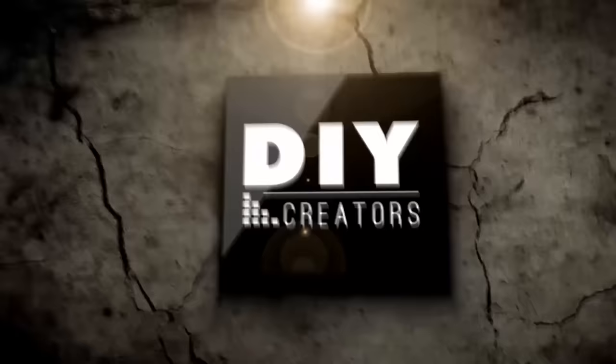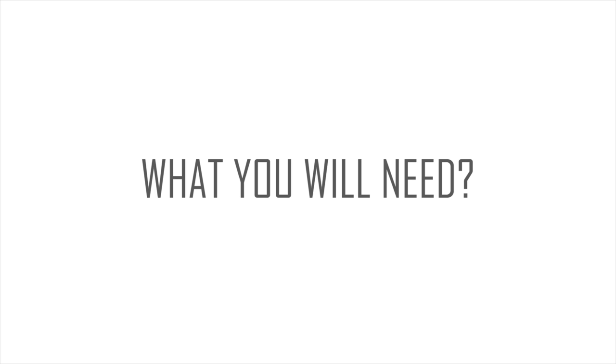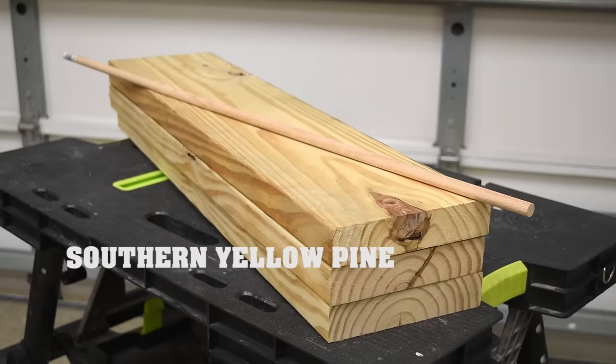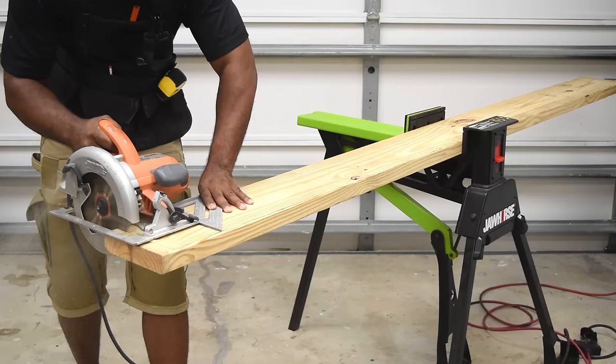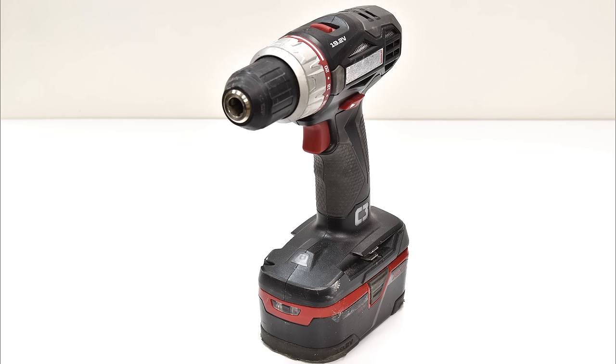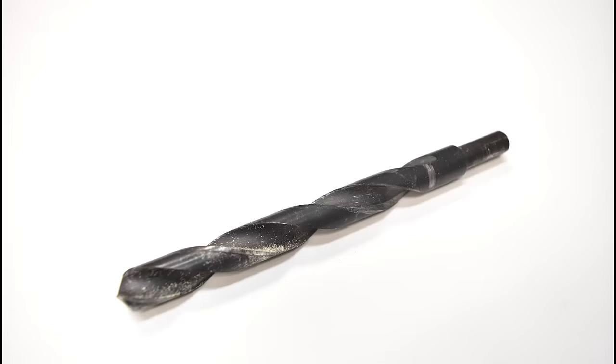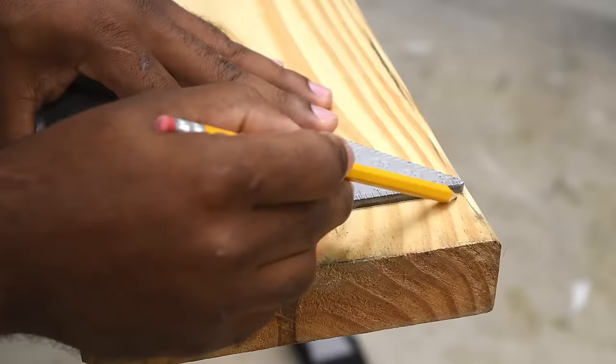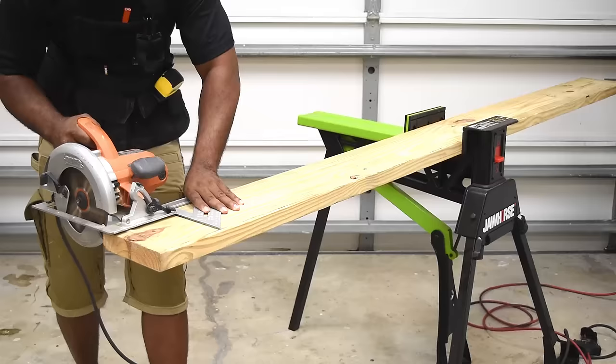Stay tuned and I'm going to show you exactly how it's made. Here's a list of things you need: one 2-inch by 8-inch by 8-foot lumber, a 36-inch oak dowel. At many hardware stores you can have the lumber cut to size, but for those who have tools, all you need is a circular saw, a drill, a sander, and a half-inch bit.